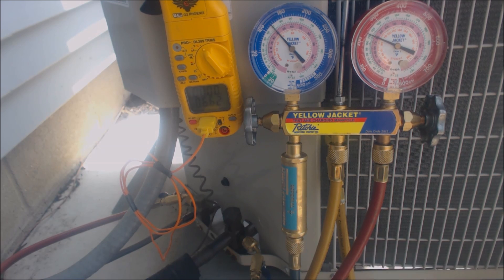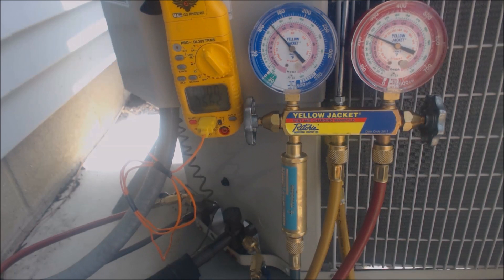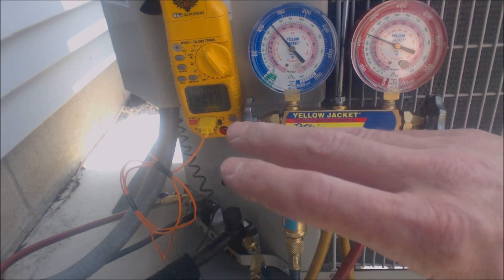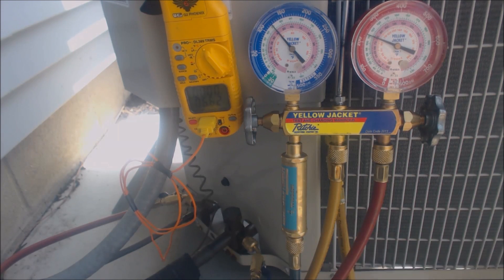It is within three degrees plus or minus the target sub-cooling, and I would rather be having a little bit more sub-cooling than less sub-cooling. Just because technicians will attach their gauge sets and detach repeatedly — every time they do that, they're stealing a little bit of refrigerant out of the system. I'm going to show you the disconnect procedure so that you don't take the liquid out of the refrigerant system. This refrigerant charge is good — so it's a 10-degree target sub-cooling, which would be anywhere from 7 degrees to 13 degrees of sub-cooling, and we have 13 degrees.